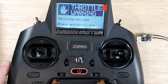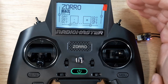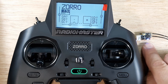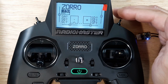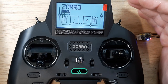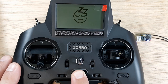Once we've eliminated the fail-safe, you can see the RXSR has powered up. There's a solid blue light — that means it's in S-bus mode. If there's no solid blue light, you've held the bind button down too long and put it into PPM mode. We want S-bus functional for later use. Hold that bind button down, then let go around 10 seconds, and you'll get the solid blue light. The red light is blinking so it's on standby, not seeing the controller, in full fail-safe — but we don't care about that right now.